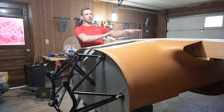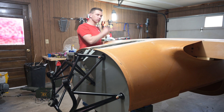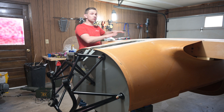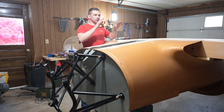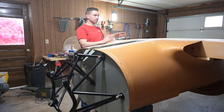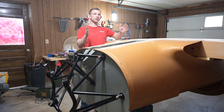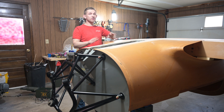What Lancer wants you to do is kind of do all of the glasswork, put the belly in, cut the doors off, and do all that stuff before you fit the gear — because the manual says to fit the gear to the doors. In my mind, that's backward. If the gear is the most alignment-critical part, the last thing I want to do is cut the gear door out willy-nilly and then try to fit the gear to that. I would rather get the landing gear in as good an alignment as I possibly can, which I think I've done, and then fit the doors to that.